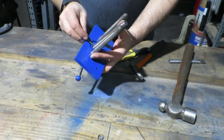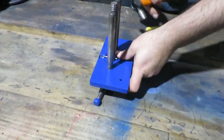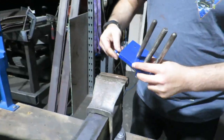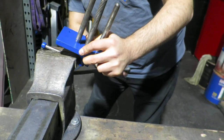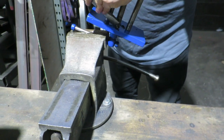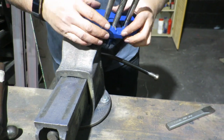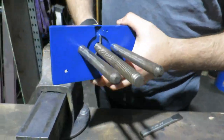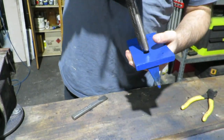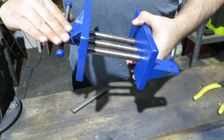Time to put a little pin into the thread so that it actually stays in place, using a tap hammer to do that. The pin is just made out of an old nail we were able to find that fit. I want to make sure it would actually stay in place, so I'm using a punch to push it to the side so it wouldn't freely come out. Now it'll actually stay in place so those top jaws will move in and out when it's bolted to the table.